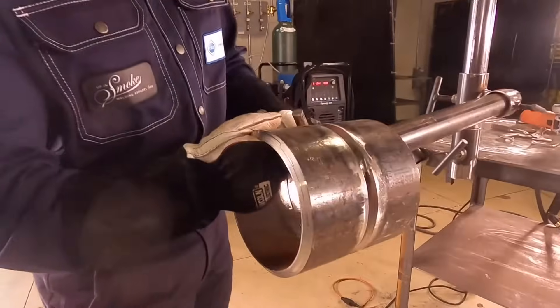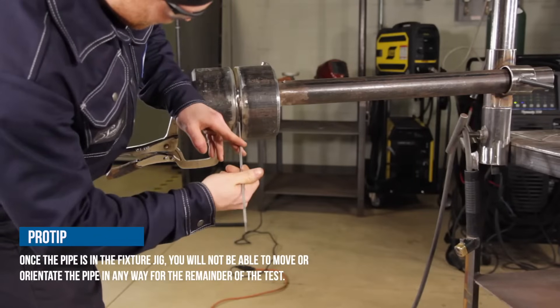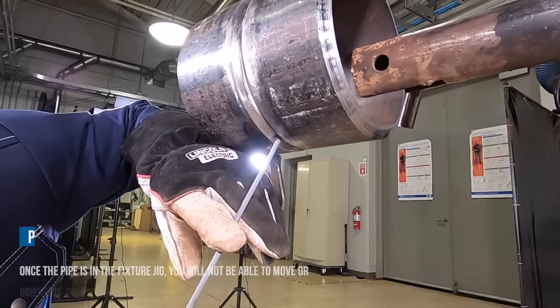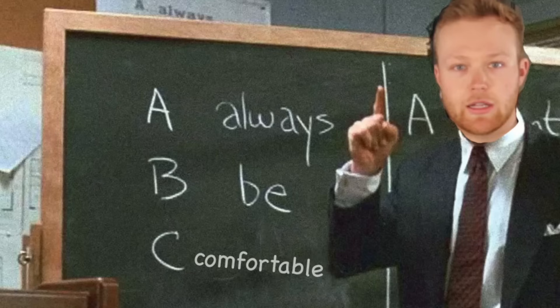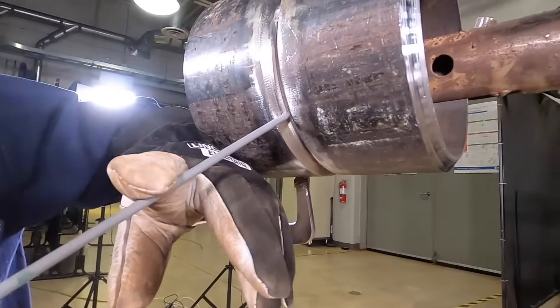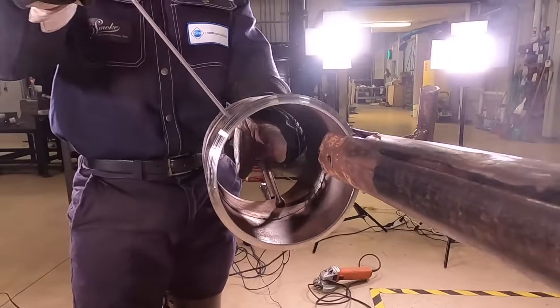When putting the pipe into the jig fixture, we ensure that we have a proper tack to come off of. We look at which keyhole is the most symmetrical on the pipe and place that at the bottom position. I clamped a vice grip to the inside of the pipe for an armrest. There's something called the ABCs of welding — Always Be Comfortable. Before welding, always do a dry run to make sure there are no obstacles in your way. For rod position, you want to be perpendicular to the pipe and always aim the rod right at the center of the pipe.